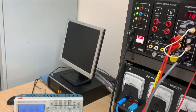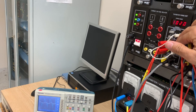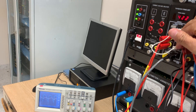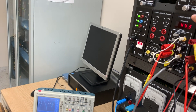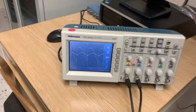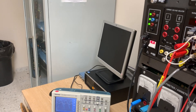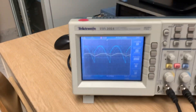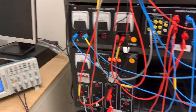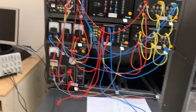I'll show you both the firing angle and the oscilloscope at the same time. Bringing the angle down to 45° — in this case the current is continuous. At 44–45° the current is continuous, meaning the inductance is large enough and the firing angle is small enough. Reducing it further to 25° — you can see it's continuous current. This concludes the experiment for the full wave single phase controlled rectifier.